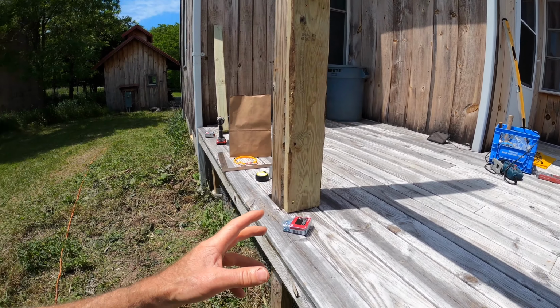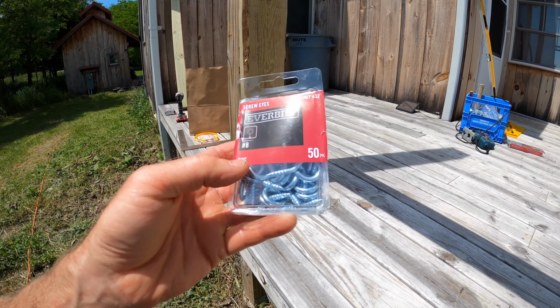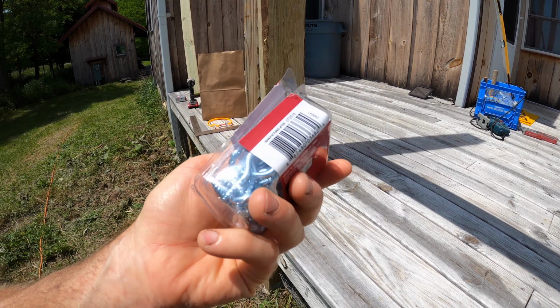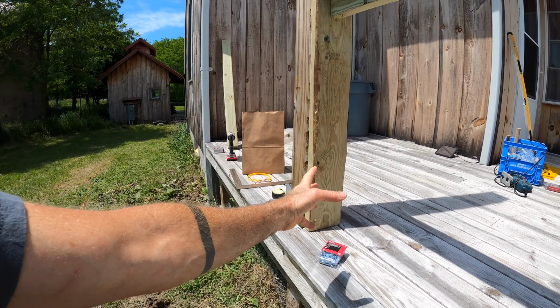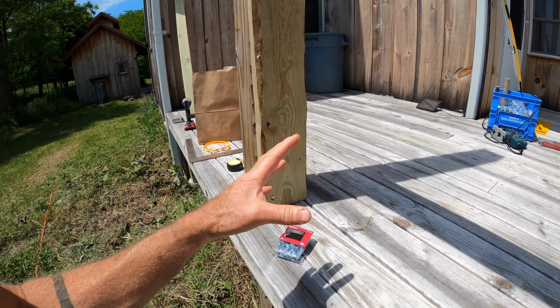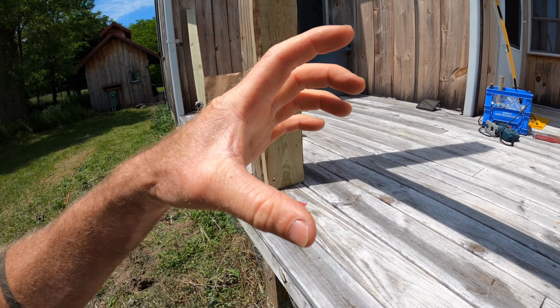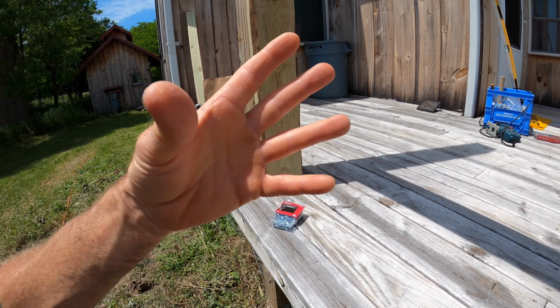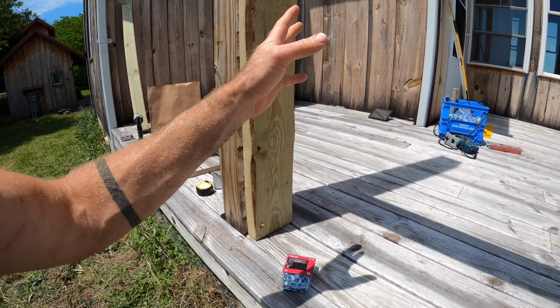All right, so about these cables, we're doing simple screw eyes. I call them eyelets, but they call it screw eyes. Screw eyes at the terminal end of every run. Code is always this 4-inch thing. You don't want to put a 4-inch orb, like a little baby head. A teeny little baby head, 4 inches. Never even seen one of those. A 4-inch head can't fit through any railing that you build.